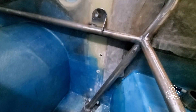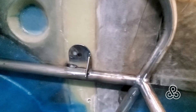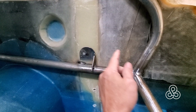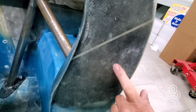You'll also see that we have some side impact protection from little extensions that come out to the plates where the strikers are going to be. Here is the vertical laminate core — these are the holes that come in from the rear subframe, two on the top and three on the bottom. That vertical laminate core bends into the floor and travels up through here. We've also got a bracket where the roll bar punches right through that vertical laminate and ties in there. The bar is about four inches wide and an inch thick, and the whole roll bar will be attached through it. As it comes around and makes this bend, the bars extend over into that door latch area pocket, so any impact into the door will be transferred through the door latch into the pipe and over to the whole roll bar structure.